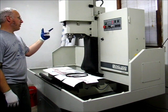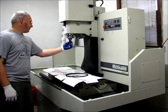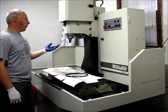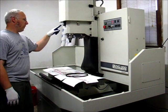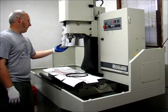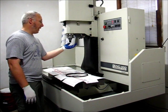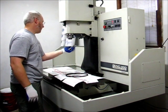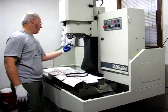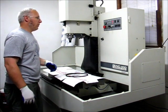The motor's turning at 4,000 RPM and the spindle's not turning — I can turn that by hand. I'm going to test what happens with the power drawbar. I'm stepping on the foot pedal and I'll stop the spindle. So it waited until the motor was stopped before it did anything.